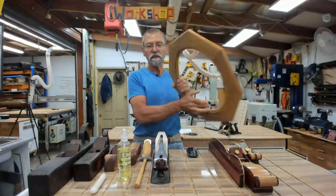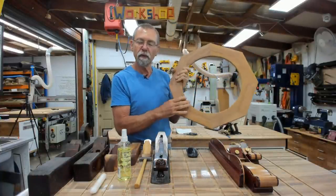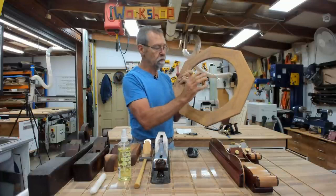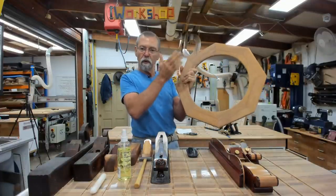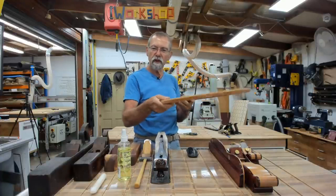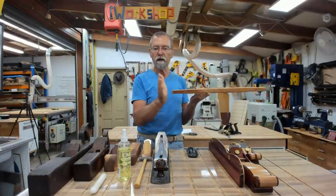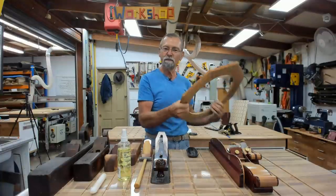So I created another one of these out of 140 millimeter wide decking. And I put a hole that was eccentric, off to one side, so that these married up when it dropped in between the boards on the deck. So all of the boards were still full boards across. I didn't have half a board that I was kind of cutting into. And then all of the boards coming up this way were cut 45, 90, and 45. And it looks pretty cool.